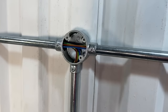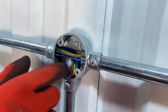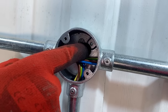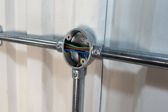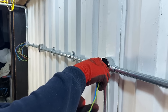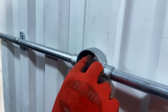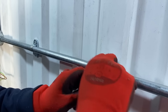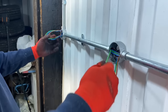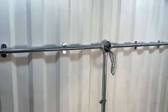We've now wired to the furthest lighting point. Inside the box, Rick dresses the cables carefully to make sure no conductors are hiding behind fixing points and that the CPC connection point remains accessible. We pull out a loop at each of the remaining positions — one here and one just further along — making our three lighting points. As we pull the loop through, it disappears neatly into the corner and a box lid will go on there. Three lighting points wired and the socket outlet done.